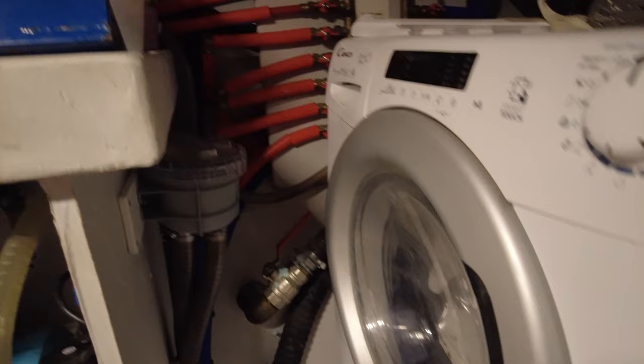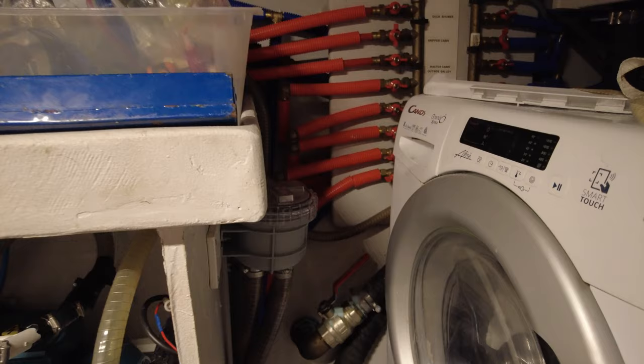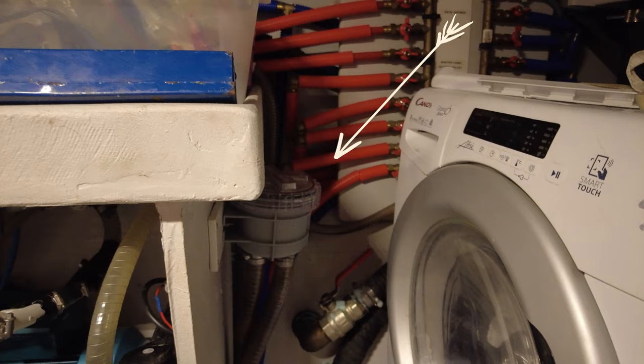Now, the morning after having had problems all night, basically I was up at 4 a.m. trying to fix the generator, because after I put a new impeller in, it shut down the generator. It had an automatic switch that shut itself down, telling me there wasn't enough raw water. So I tried something totally different: the seawater strainer was above sea level, and I simply moved it down, and that makes it easier for the impeller. Rather than drawing air and water, it was just drawing loads and loads of water. In fact, the pressure was much more, and it's been working perfectly now. We have had no problem since.